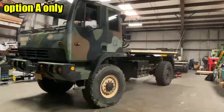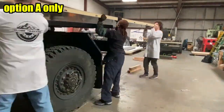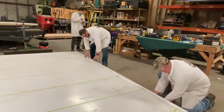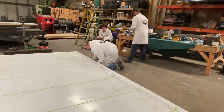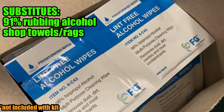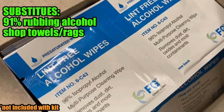When the outermost pins are installed, remove the floor panel from the subframe and place it on some shoring material or large-sized dolly carts. Then begin to remove the outer plastic wrap from the bottom and top of the floor panel, sides and front. Peeling back six to eight inches of protective wrap will do — do not remove the entire protective film. Prep the panel and aluminum extrusion lower side rails by thoroughly wiping them down with alcohol wipes.